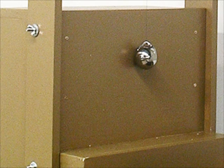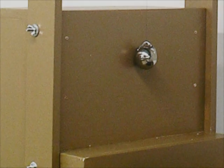approximately 50 millimeters in diameter and with a mass of 500 grams plus or minus 25 grams. The base of the test fixture serves as the impact area and mounting plate for our vandal shield test subjects. The steel sphere is swung as a pendulum from a height of 1300 millimeters in order to apply a horizontal impact on the center of the test subjects.